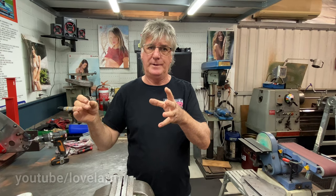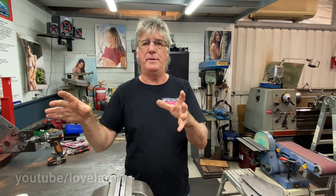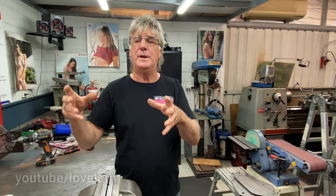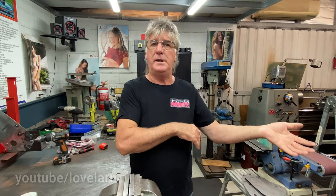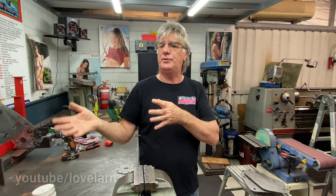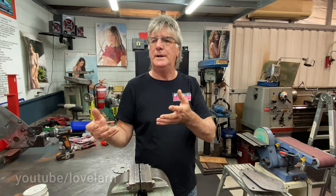Okay, so they're heated to remove moisture, lint, all that type of thing from the reel. And then they're primed, so spray primed. So there's a fair bit of time there, mixing paint, applying the primer, cleaning the gun, etc. Then it's nice to leave that for several hours, colder weather more. If I'm doing a batch of them, it's great to leave them overnight.